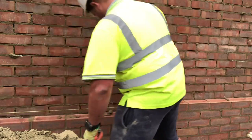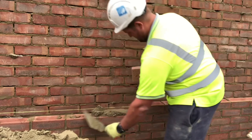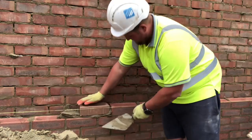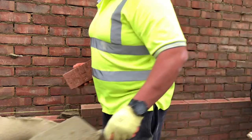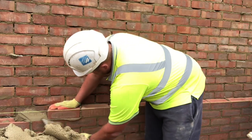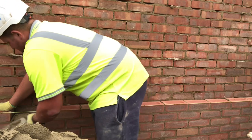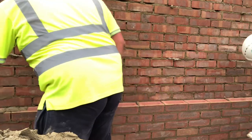It'd be nice to have a change up. I find square bricks easier to lay because of the nice arises, and the perforations allow somewhere for the mortar to go — you generally need more mortar on perforated bricks. Whereas we're cleaning out two big tubs on a good day on frog bricks, on perforated bricks we're going through two and a half tubs. We normally get through the mortar by ten o'clock on frog bricks, but on perforated it's more like two o'clock. So we're doing maybe two and a half tubs on the perforated.